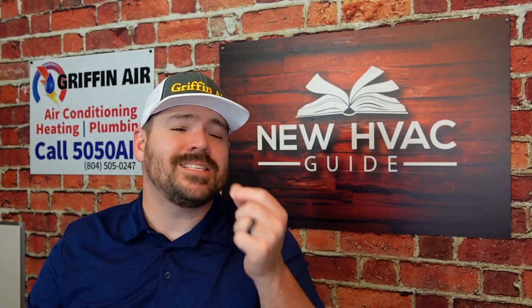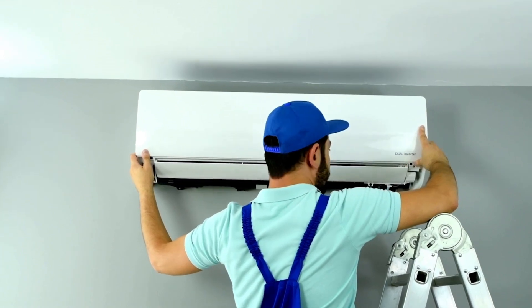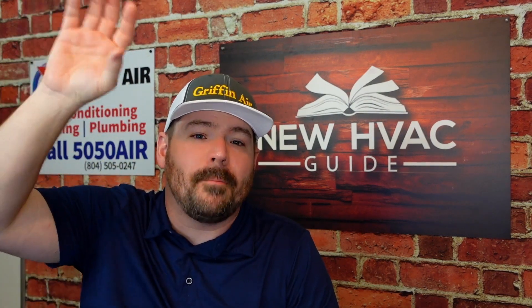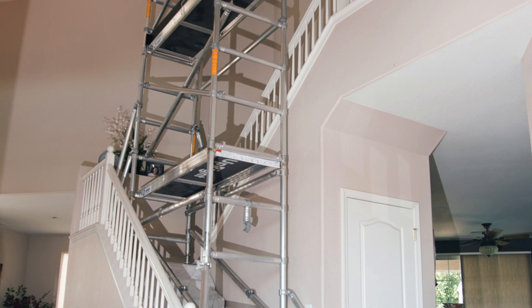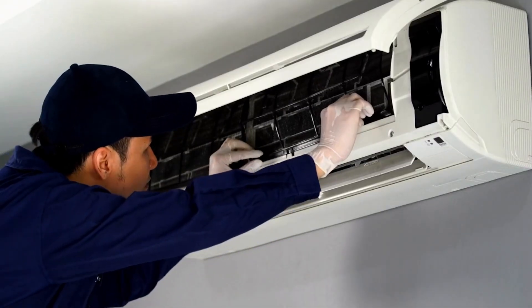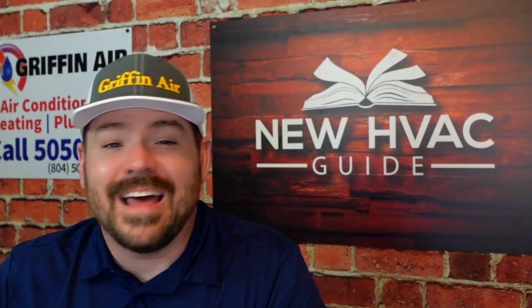Next: maintenance. This is one I see missed all the time. Realize that unit should be maintained — someone is going to need to be able to get to that unit. What if something's wrong? What if you call me to repair it but I can't physically get to it? One example: I've seen folks install a unit way up high above a stairwell, and then they say, well, when it was installed we had scaffolding and it was no problem — but now the scaffolding's gone. Now you've got this beautiful finished home and we've got to figure out a way to get to that unit to maintain it, clean the filter, which you should be doing periodically. Installing that unit somewhere you can't easily maintain it is a big problem.